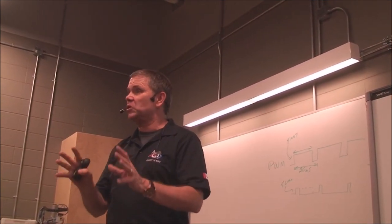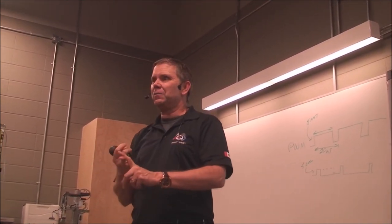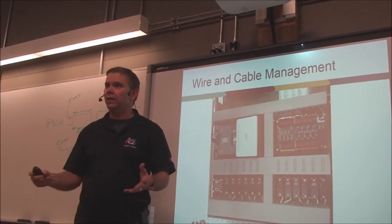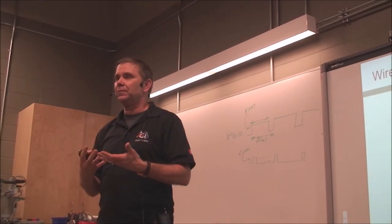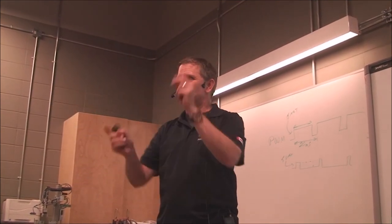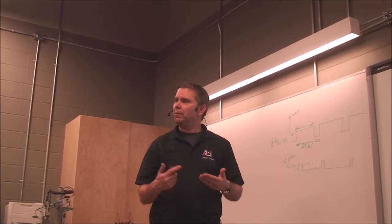If you have loose and sloppy wires, pickled three ways to breakfast, it's a nightmare to troubleshoot. It's a nightmare to reposition things. Sometimes I'll see situations where wires go over top of components, they're racing here and there, and it's sloppy. If you're going to learn something from building a first control system, you should learn how to do it professionally and well. And I can tell you, your own robot safety inspectors and the CSAs would appreciate a nicely laid out system rather than one where the wires are just running like an afterthought, right? Like a bowl of spaghetti. So there's lots of ways of managing your wires.